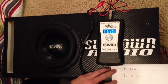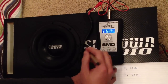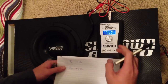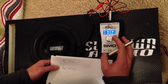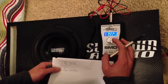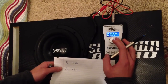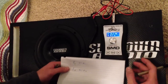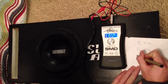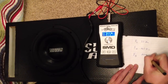And then to find what your box is actually tuned to, you're going to find the lowest impedance in between the 27 and the 51Hz. I saw 8.2, 8.1. So this box is tuned to — this is going to be called your FB — 32.4Hz.